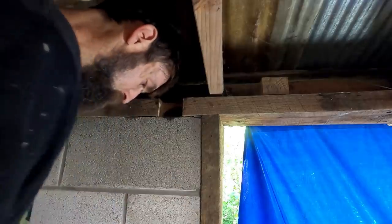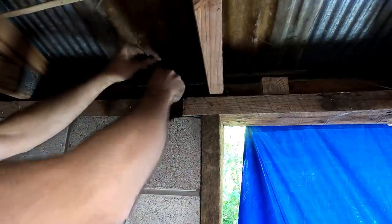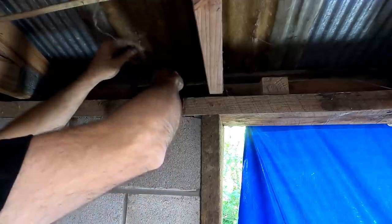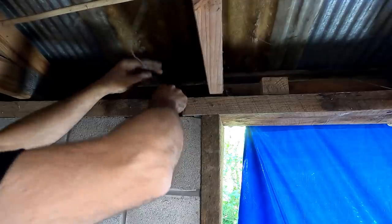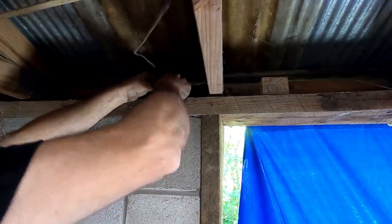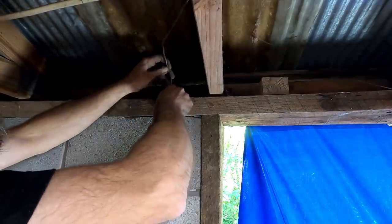Oh, come on. When I mixed up this grout mix, I mixed it relatively thin. All I'm using is a piece of copper wire here, reach down through here, kind of rod this stuff down, and it definitely helped. And I had to add a little after I did it each time. So that was it. Pretty simple, really. Straightforward. I probably should have done this 2 weeks ago.